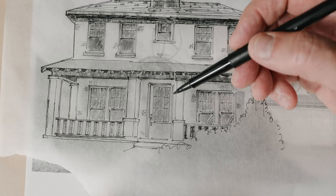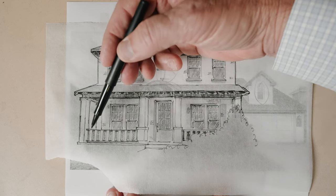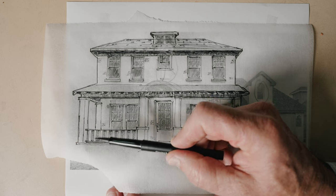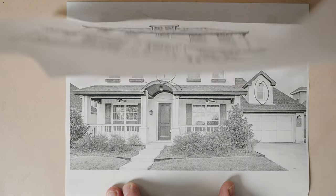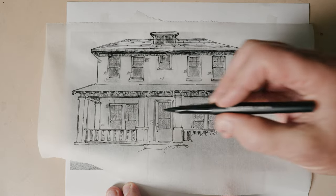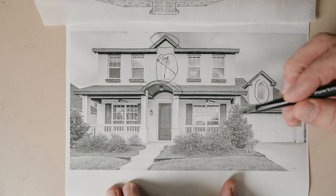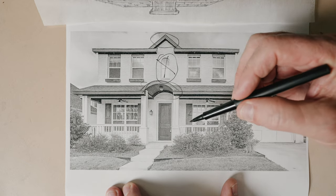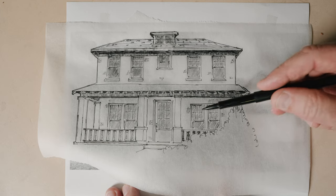This is a typical turn-of-the-century, 1910-1915 door that I put in here. Notice too, the balustrade I put across here is a slat balustrade where these are the slat boards going across - a boxy, interesting look that I really like. I haven't had to change much. I did separate the windows by putting a five-inch mull in between here. This kind of double hung where they're mulled right back to back looks bad. I've also deleted the shutters - these are screw-on shutters that don't make any sense, so we're not going to use those.